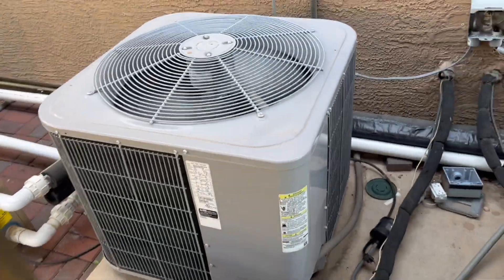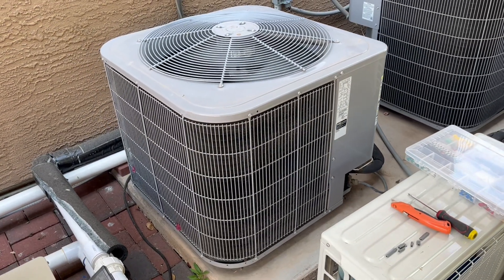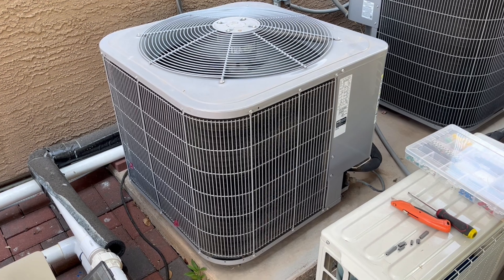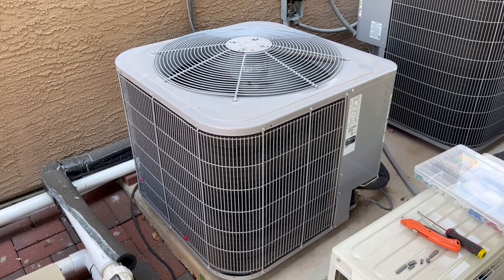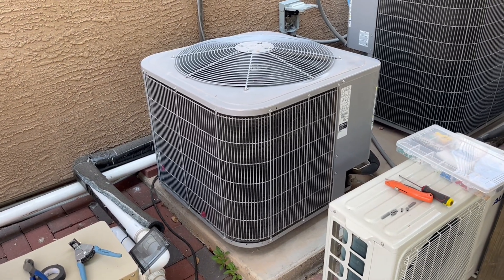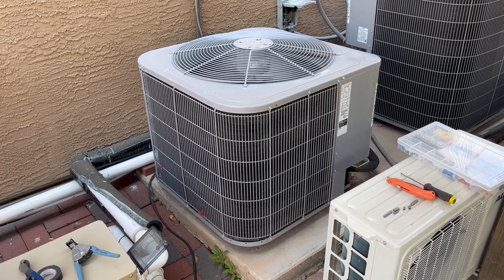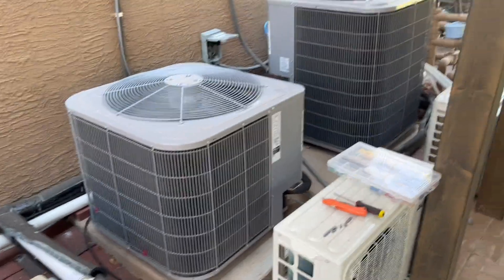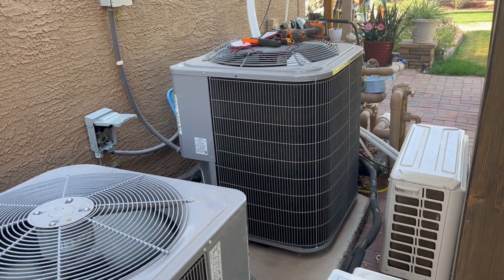This three-and-a-half ton unit has all my vents into my rooms upstairs, and it's running off those 34 to 35 solar panels at 250 watts. I can hook up to 70 panels, and I was only at 16 to 17% of my load — so that four-ton unit over there I should be able to fire up too.